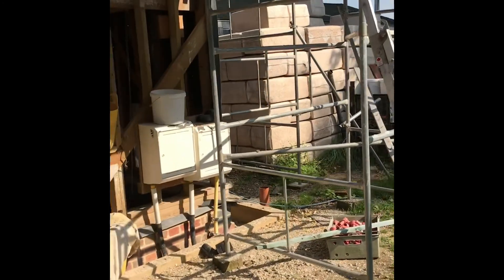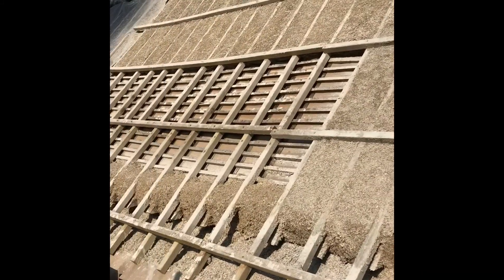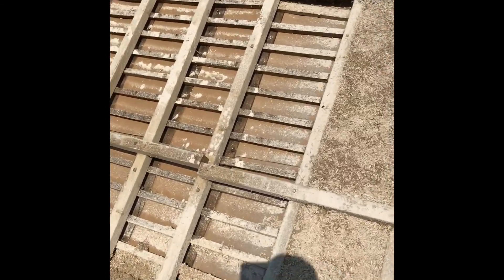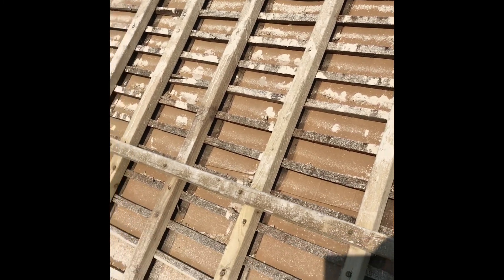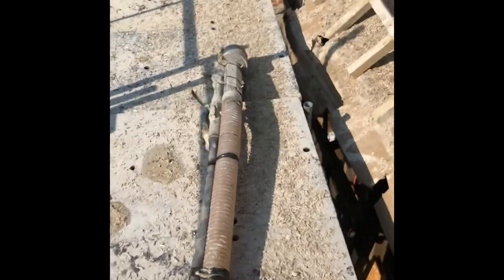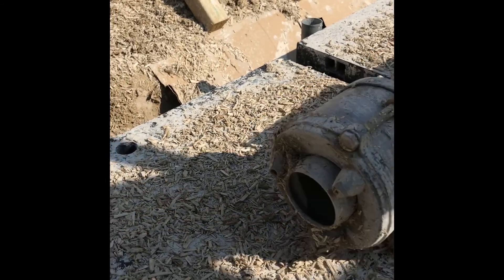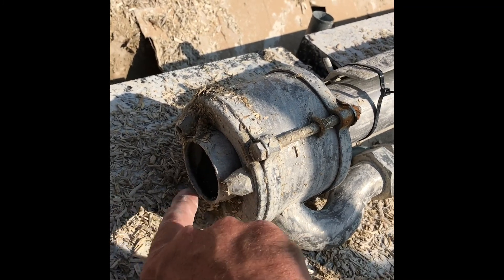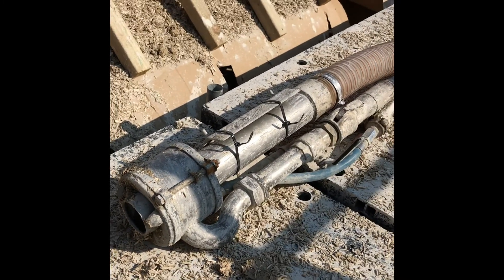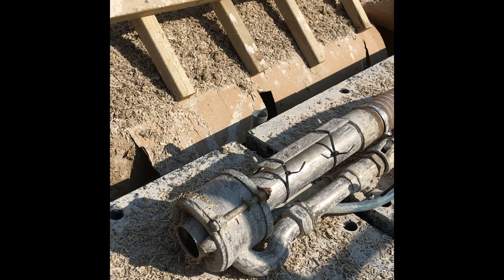This is the other side of the roof. I've done a little bit already — that's where I finished yesterday. You can see the cardboard I'm spraying onto and the old tile battens and rafters below. I've added these guides to give me a height reference, and they'll also strengthen the roof a bit. Here's the lance — the hemp comes out dry through here and the binder shoots out these three little nozzles wet, blasted by compressed air, and it mixes in the air as it travels to hit the shuttering.